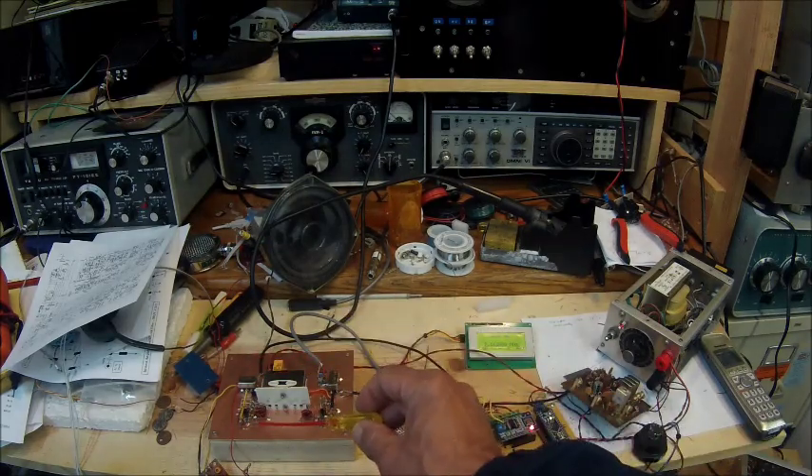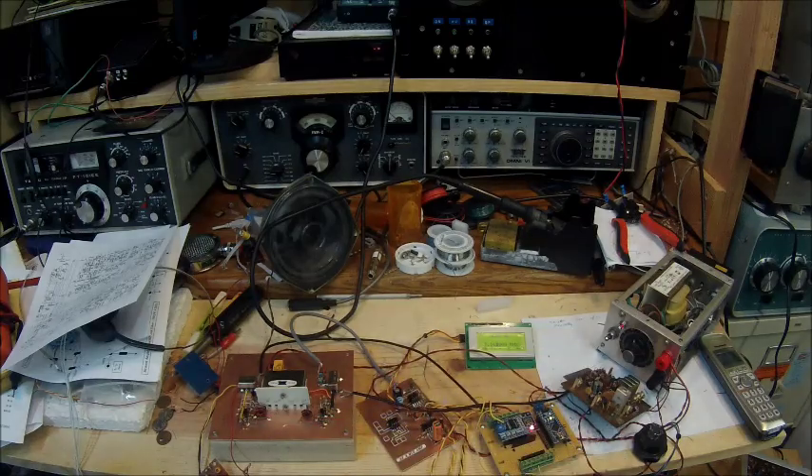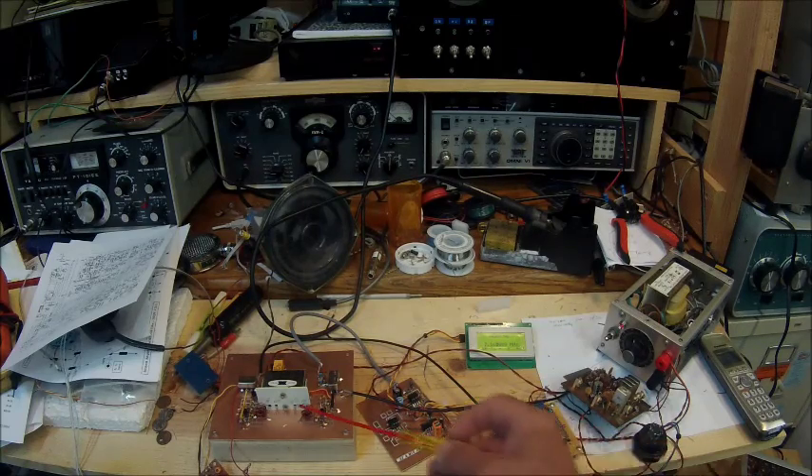This is the first bilateral amplifier, which is nothing more than a common pair of 2N3906 and a 2N3904. A couple of ferrite cores match the filter to the 50 ohms of these two amplifiers.